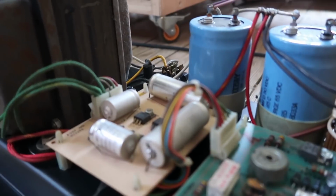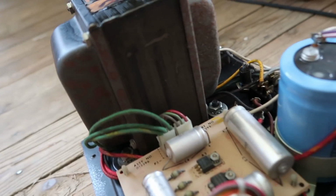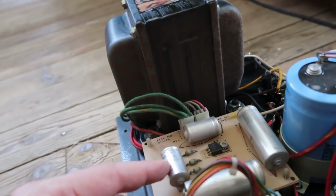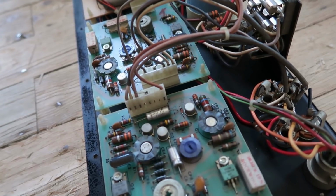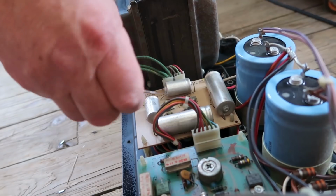Okay. I would start sniffing round about there, somewhere. Yeah, it's coming from there. Okay, that'll be the rectifier then. I mean, these are all electrolytic capacitors, so I think that on this occasion we might as well change them, no? Maybe, if you can find the right ones. It depends if they're good or bad ones, though. If they're good, there's very little point in changing them. Right. On the other hand, if they're hot...